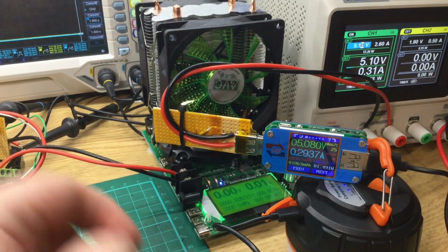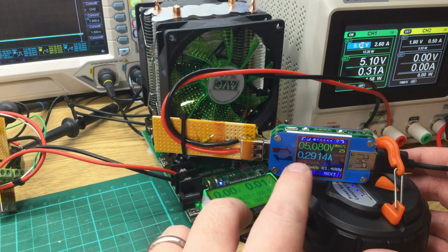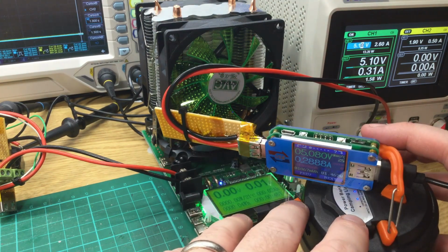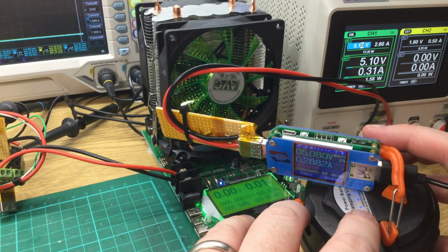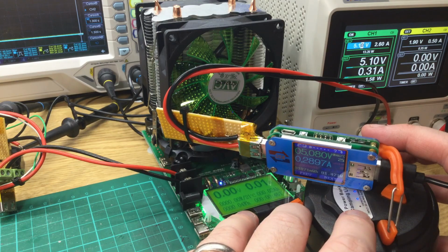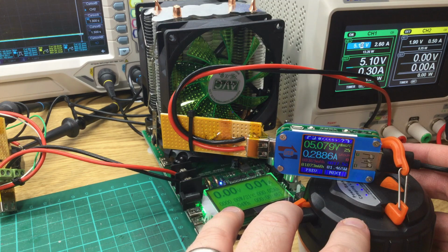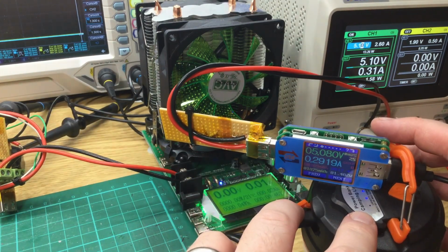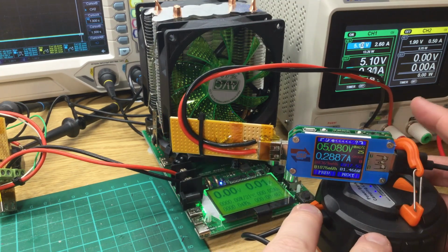This is still recharging, so just a quick update. It started off drawing about 1 amp. It's getting closer to 0.3 at the moment. I've noticed on the top, you might be able to see this, the status lights appear to flash while it's charging, and I assume that means it's somewhere between 75 and 100% full, which would make sense with the dropping off of the load. So that's useful to know. You can actually see approximately how fully charged it is. I will probably test that once I've discharged it to see if it behaves the same, but that's interesting.